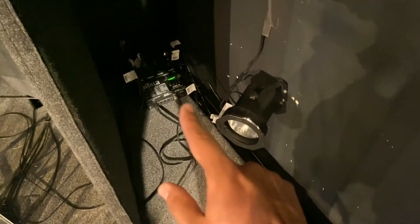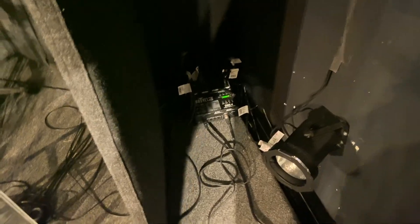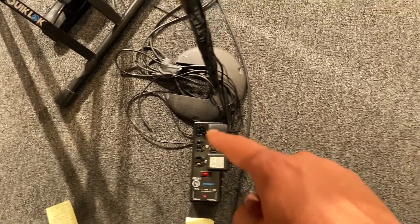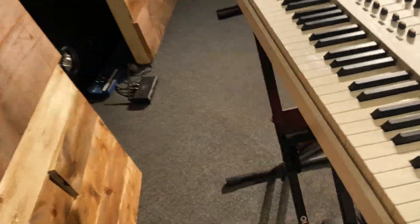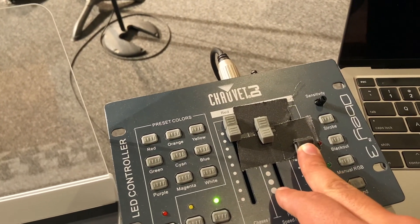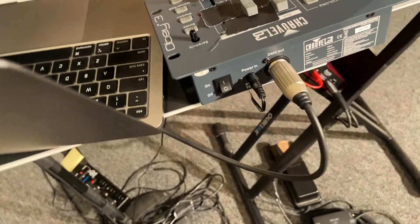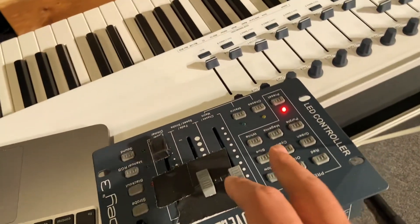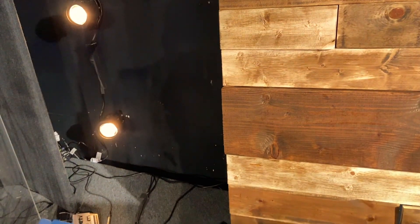So that's all you need to know. Make sure that big fat wire is plugged into the outlet. Make sure the DMX pack's left-corner power switch is on and the screen says A001 — that confirms you're in the right mode. Turn on the power strip, and make sure the plain black outlet plug is connected; that's the one leading back to the DMX controller. Then press macro, fade it up, and you're ready to go. If you plug everything in and nothing comes on, the off switch might be engaged — check for that, flip it on, click macro, fade it up, and you're all set.